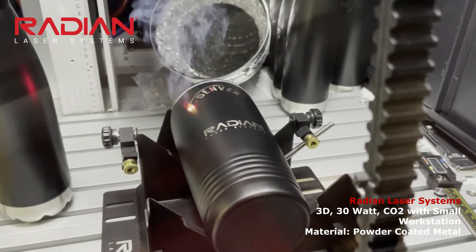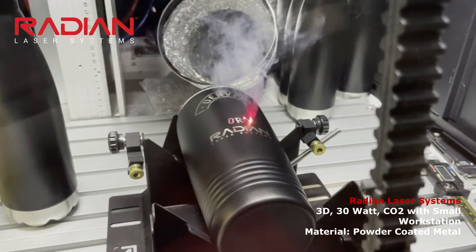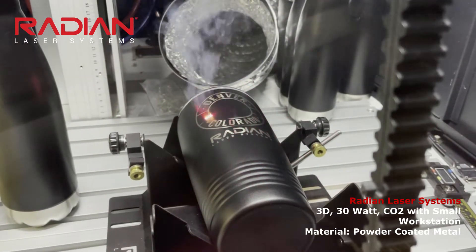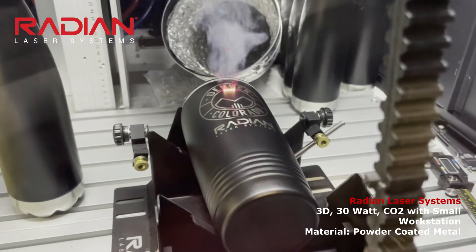The system's primary feature is a high-performance, 3-axis Galvo, which allows for marking on curved and irregular surfaces without using a rotary. This is a big advantage over traditional flatbed-style cutting lasers. Galvo systems are designed for high-speed marking, and flatbed systems are really designed for cutting.